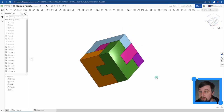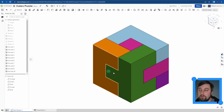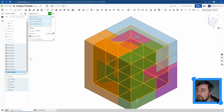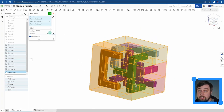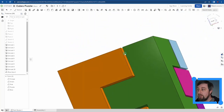To make this 3D printable, we need to adjust for tolerance and printer bleed. First, use the Move Face command - highlight the whole thing, click Move Face. It defaults to moving outward; click to flip inward. We don't need much - just 0.02 inches instead of 0.25. Enter, check mark. This adds a small gap between pieces for clean 3D printing.